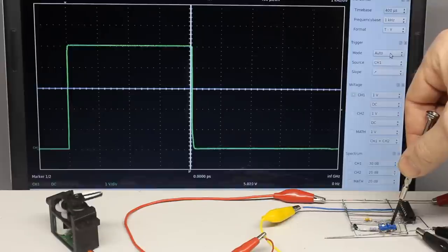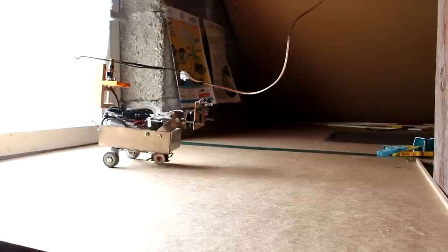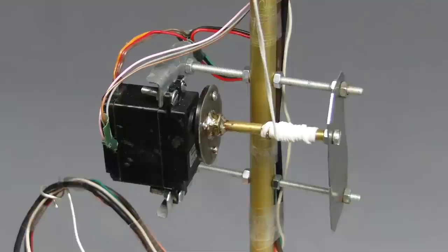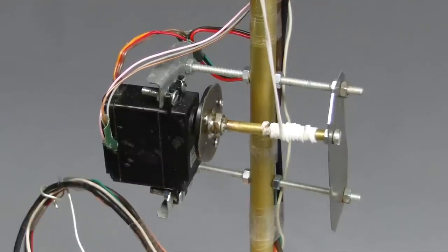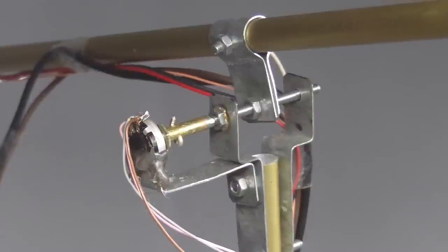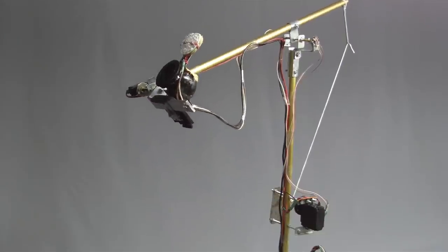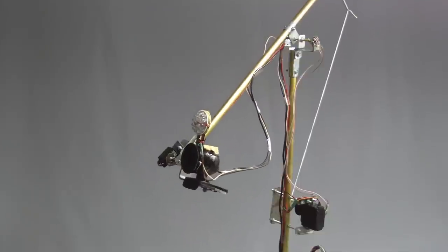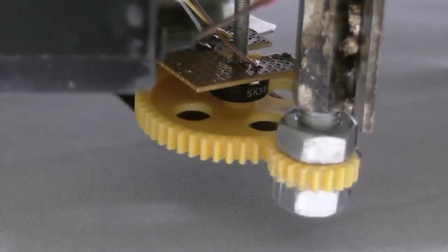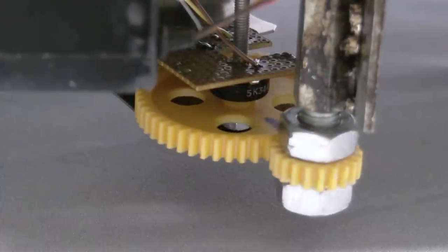The available range of drive speed depends on the motor driver circuit and varies between different manufacturer types. Such hacked servos are very common drives in small-scale robotics. This remote controlled camera arm is actuated by a hacked servo operating as a winch. The potentiometer serving as sensor is attached to the pivot point of the lever, so the angle of the camera arm is adjusted by the electronics instead of the servo horn angle. The lever moves slowly, but the low electric power of the tiny servo is sufficient to lift the camera. The angle of rotation can be extended beyond 360 degrees by using two gear wheels and attaching the potentiometer at the larger one, while the smaller wheel is mounted at the pivot axis.